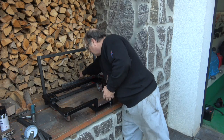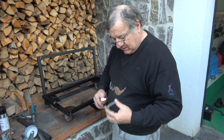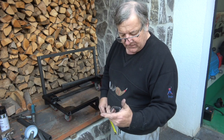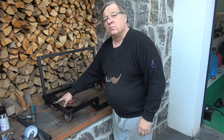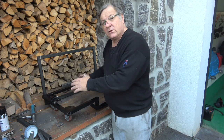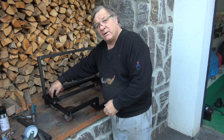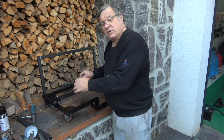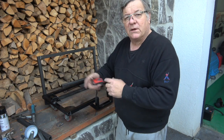This particular one is a very heavy box, but it's just something I happen to have. This is a 5 by 5 centimeter, but it's at least 5mm thick. It's extremely thick, this. I did that because I can put the welder up very high and get good penetration on the side. So the way to do it is to get it lined up where you want it, have this plate attached to the mounting, and bring whatever your support plate's going to be up to it, and just tack it in place. And do one at a time until you get it right. Just tack it, lift the engine out, and then take it away, take it out and re-weld the whole thing completely.